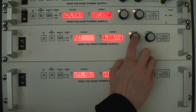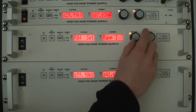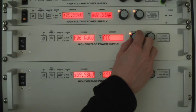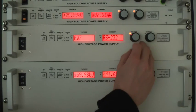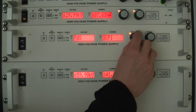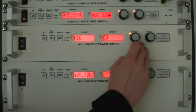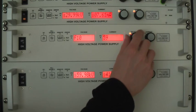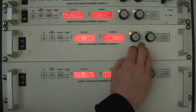The next two entries for auto start are not available for some units such as this one — details regarding that can be found in the manual. If the unit is equipped with this functionality, you can decide here that it automatically ramps up after power on. In entry number seven you can decide which interface you want to use; of course the unit has to be equipped with the specific interface. In entry number eight you can choose the instruction set — basically there are three different command sets available for remote control. In entries nine and ten you can change the base address for the IEEE and CAN interface; if you use several units with the same base address there will be malfunctions. For example, it is possible to operate up to 64 units on one CAN line. In entry number eleven you can activate an echo for remote control, meaning the unit confirms a command by sending it back to the computer.